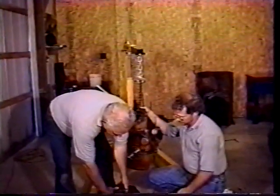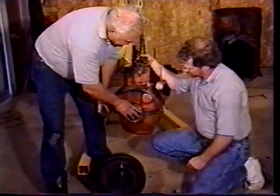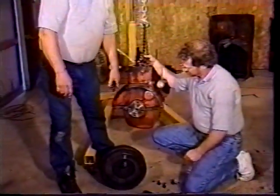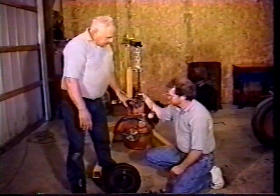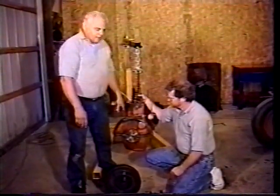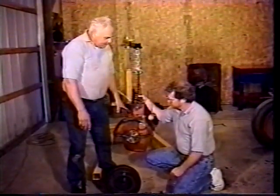It has four bolt holes, and there's four in the crank. And they're unequally spaced. You can only put it on one way. And the best way is just trial and error. Get them lined up right.